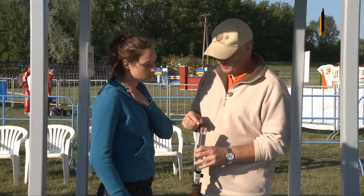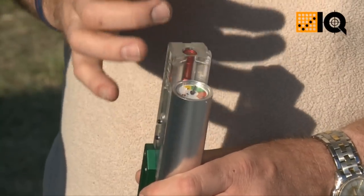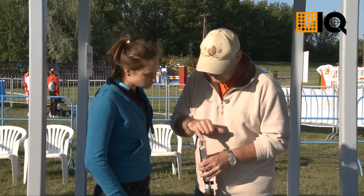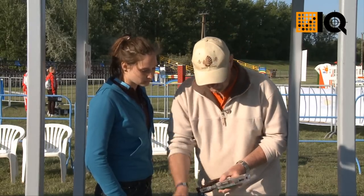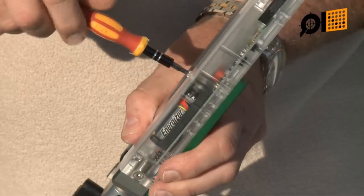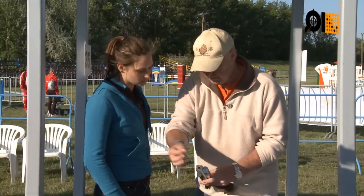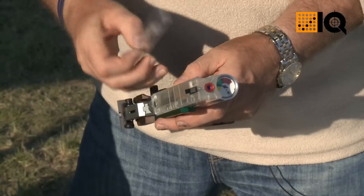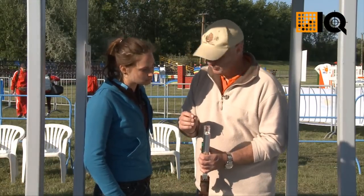The trick of doing this: those three screws are important to set and hold the laser. The laser is fixed here on the side on a ring, so when you move the screws it is stable in the back, and you can move the laser very, very tiny with the screws. The first thing you have to do is take this screw a bit out so that you can actually remove the whole sidebar — otherwise this screw is not reachable.